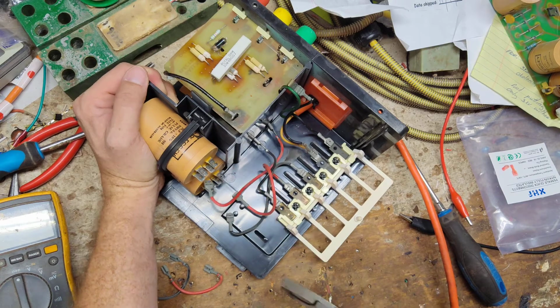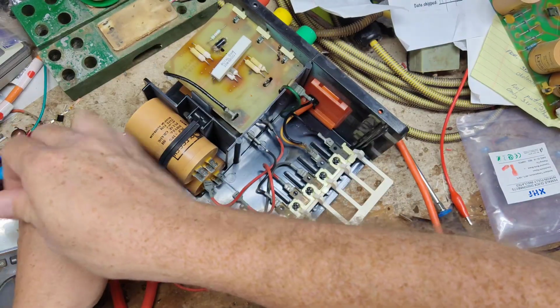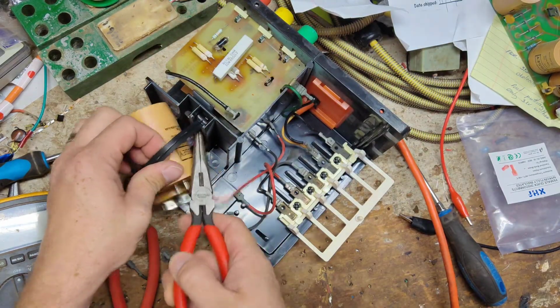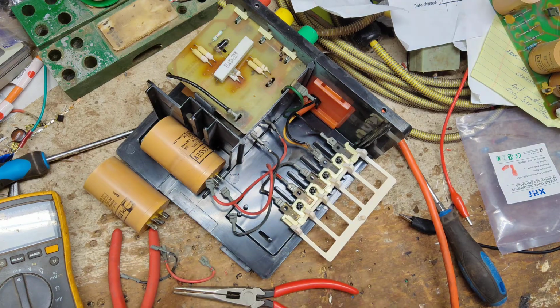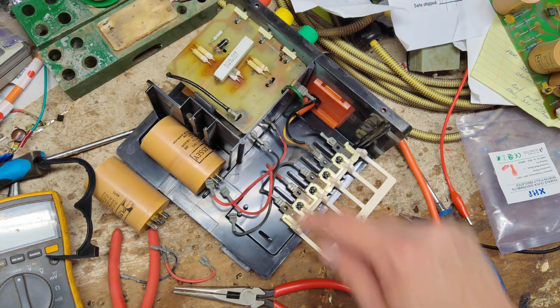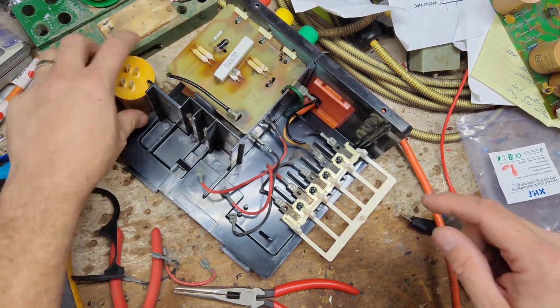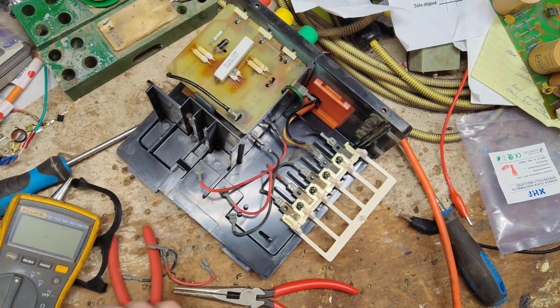This could possibly be the issue why they're only getting 3 kV, but typically, even with them being weak, as long as the transformer is good, you'll still get good voltage up here. It will click a little faster than normal, and it won't handle the load on the fence worth a darn. But he said it read 3 kV even with nothing hooked up to it. So get a couple new capacitors for it.